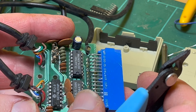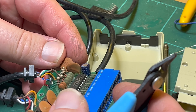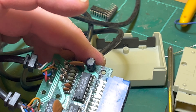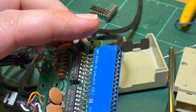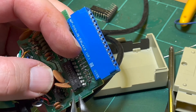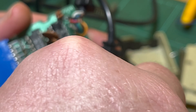I'm going to replace these capacitors - they're all 473s. I'm going to replace those as well, and might as well replace this 100 microfarad electrolytic too. Right, this is going to turn into a major job. Let's get rid of the ceramic disc capacitors - I hate those ceramic disc capacitors.